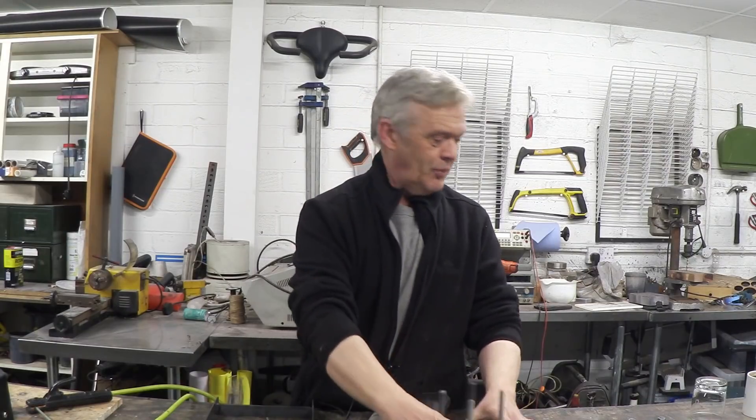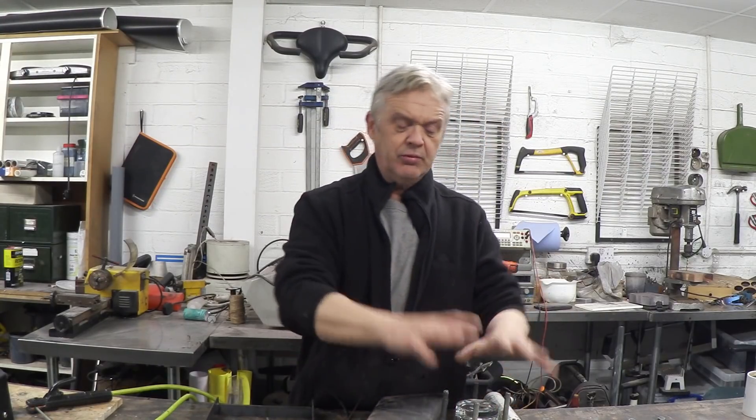We also ran the silicate down to the trap — the first trap that catches the tar. I've disassembled it here; it's nothing more than a couple of metal plates, four bolts, and a glass. The glass goes in there and the plate bolts on. We've got a glass-to-metal union there which is by no means adequate. It's just at the bottom of the cyclone filter, so it's likely to get quite hot. So we need a temporary joint that can withstand the heat, and there are a couple of options.